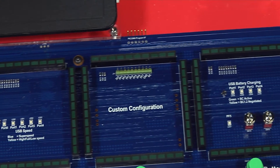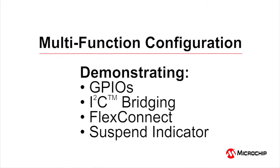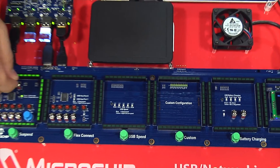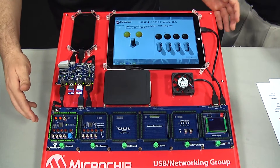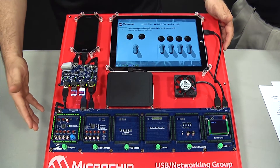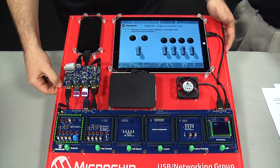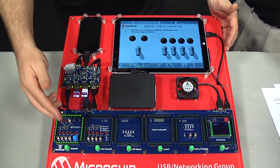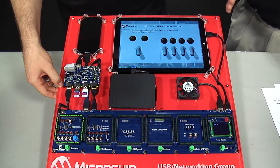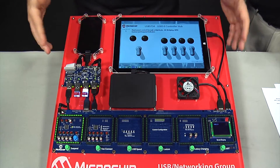We'll go through all six configuration modes. Mode number one is the multi-function mode, which also includes the suspend feature. In mode one, there are three GPIOs that can be used to interact with the USB host — to indicate the status of a digital device or drive it. Two pins are reserved for USB to I²C bridging, currently connected to a Microchip I²C-to-GPIO bridge. Two other pins serve as a suspend indicator, showing when the hub is in a USB 2.0 low-power state or active state.